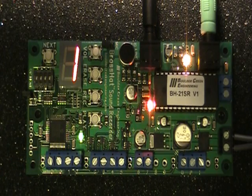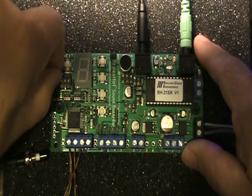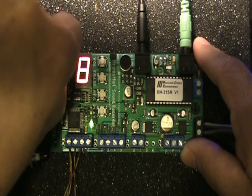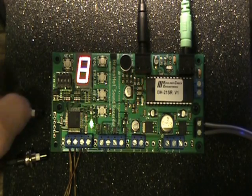Now let's play with our recordings. Push buttons have been connected between ground and on-demand trigger inputs 0 and 1. The edit jumper is closed. We now set an option switch to play the previously recorded background track, track number 8. Push button 0 interrupts the background track.